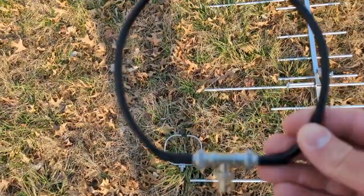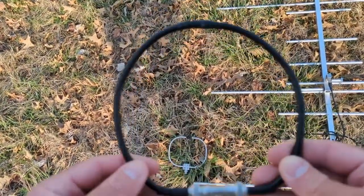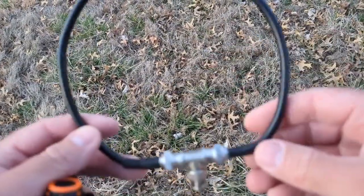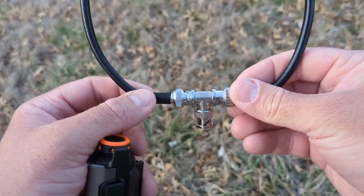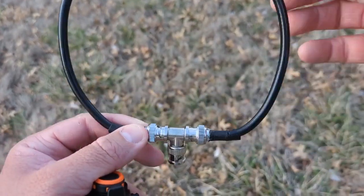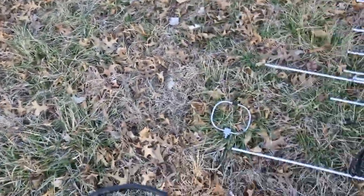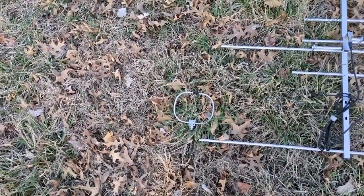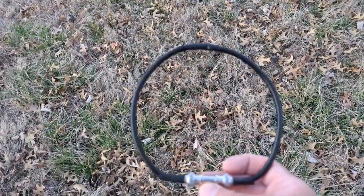This homebrew loop is made out of coaxial cable — I can provide a link to the RASA YouTube videos on how to make these. All you need is some coax and an exacto knife. You break the shield — the outer braid of the coax — and leave the middle intact. One end is connected normally with the outer connected to the body and the pin to the center. On the other, you only connect the outer and not the pin, and then you have a T junction. This loop performs identically, as far as I can tell, to that Arrow Antennas loop. That one is 80 dollars, higher quality and more durable, but this homebrew one will work if you're just trying to play around.